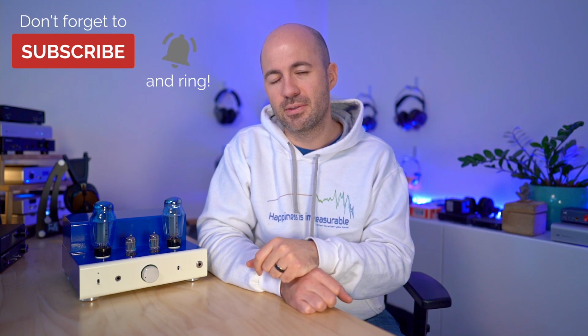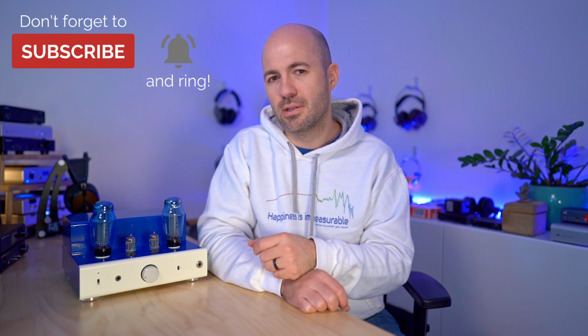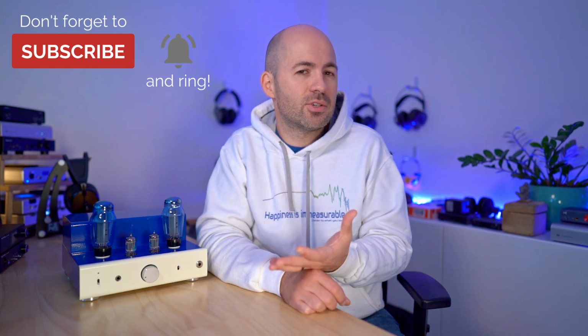So my advice to you if you're making modifications to this is that if you are going to play with those little tiny low ESR capacitors, make sure you're sticking to low ESR capacitors in their place. And honestly, I don't think there's a lot of benefit in changing them anyway. So it's not something I'd recommend you do, but if you do, make sure you stick to low ESR.